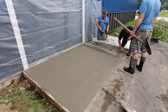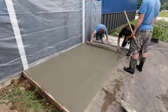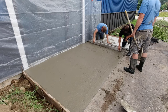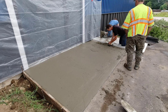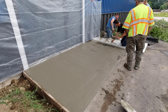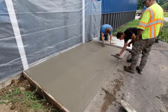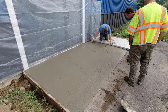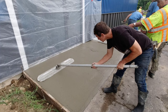You can see how I'm digging it away from the asphalt — that's just the concrete slightly sagging towards that way as we're screeding. It's still going to be a little high there because of the looseness of the concrete right now; it's hard to get it perfectly matched to the asphalt. We'll do that a little bit later coming up in the video.